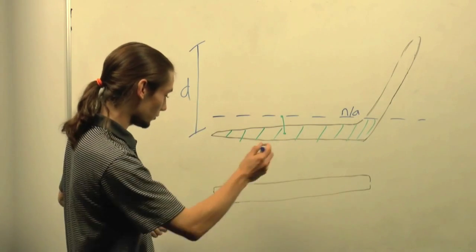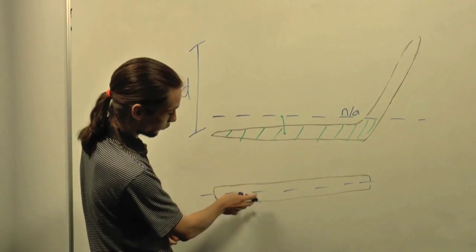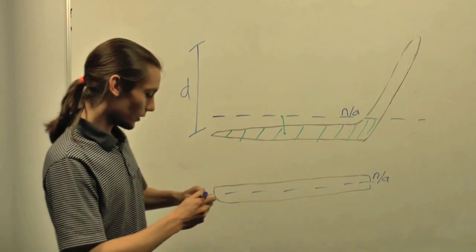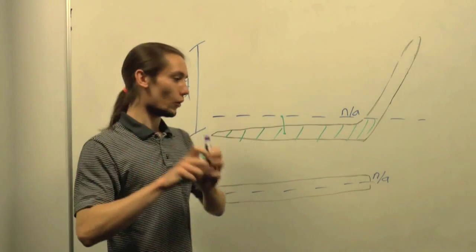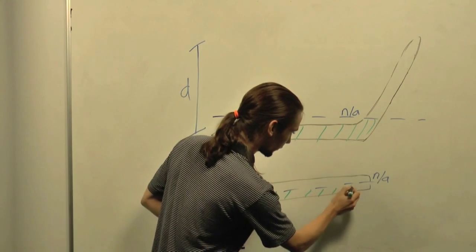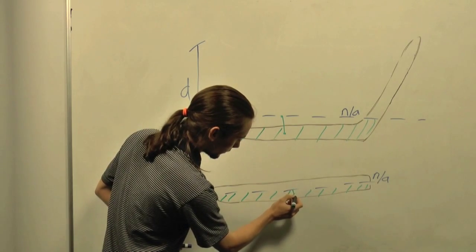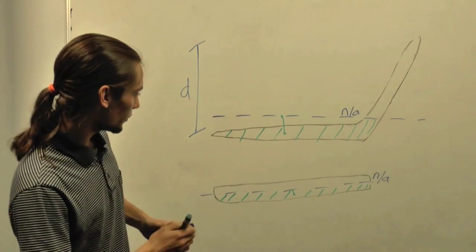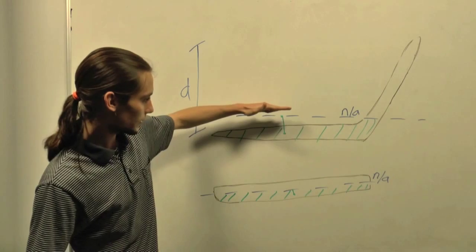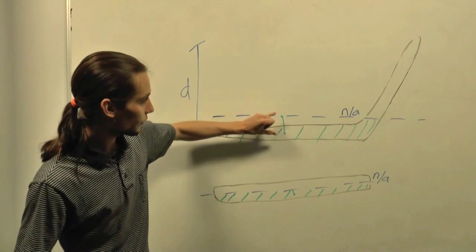So we'll draw on the neutral axis for this section, and it's going to go straight down the middle because the moments of area are going to be completely symmetrical on either side. And so if we take the area on either side, let's take the bottom as well, just so it matches up with the other diagram, then we've got this area times this lever arm. You can see that by having this section here, you've moved the neutral axis up considerably. So not only do you have a bigger area, but you've drastically increased that lever arm.